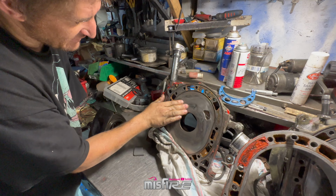Any big grooves? And wear, excessive wear anywhere? Cracks maybe through here. Get your crack through your spark plug holes. Can you tell me the difference with the trailing and the leading spark? How that works? So when it's going around the leading one goes off first, the trailing one just picks up any of the excess gas in there. And so that's leading, this is trailing, the little hole. And the big boys put another spark plug in up here, third one, just to make sure everything goes off.